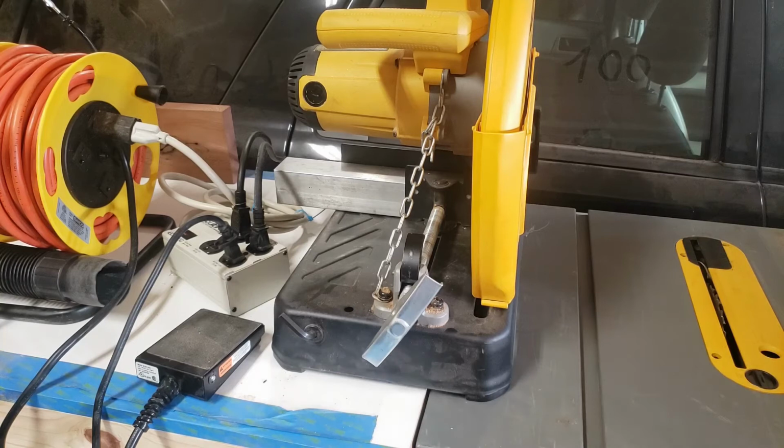So some of the scenarios that I could think of were, maybe you want to have just a power rail and a single soft starter, and then as you go around from tool to tool, you've got soft starting for each of your tools. Another one would be you've got multiple people working in the same workshop, and you want to, again, have a single power rail, and you want that power rail to soft start all of your tools, even if they're running simultaneously, but starting at different times, maybe one starting while another one's already running.